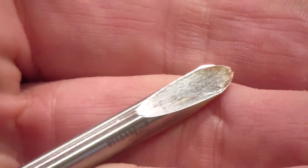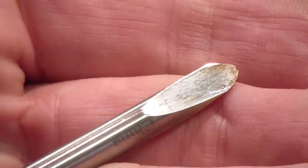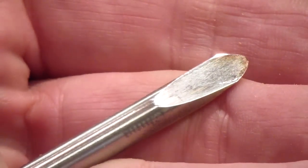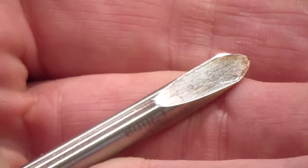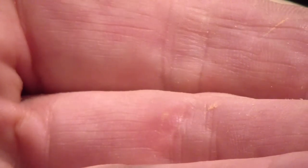This face was down on my grinding wheel and just ground away some of the steel. As I go along, if I've modified the edge, it'll depend whether I've modified top and bottom as to where I grind. If it's just normal use, I'll just swipe it like that if it needs a good sharpen. If it needs just barely honing, then I turn it upside down and lay it on like so.